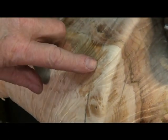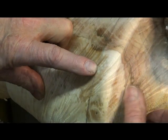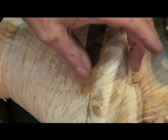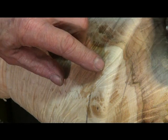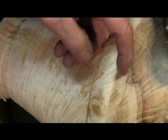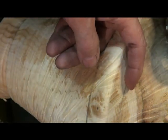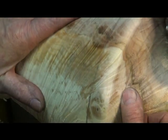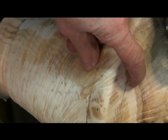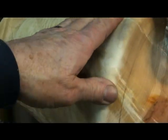I put these pencil lines on here and here because my spring is smaller than the blade. I don't want to come out with my spring and have the blade cutting over here. Same way here — I don't want to put my spring out where I think the thickness is okay and then have it cut through. So that's why I have these lines; it's just a reminder. I mark the tool, I mark the piece — I do a lot of things to aid myself.